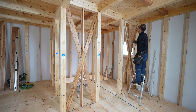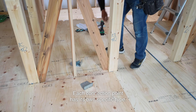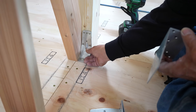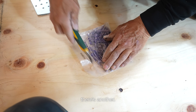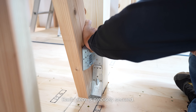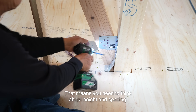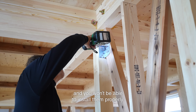Now I'm installing the hardware. Each connection point has its own specific type — there aren't many that can do double or triple duty. For diagonal braces there's one type. For the tops and bottoms of columns there's another. You don't just use one big piece of hardware for everything; each piece is precisely secured. So depending on the spot you have to use multiple different parts, which means you need to think about height and spacing — otherwise the pieces can interfere with each other and you won't be able to install them properly.